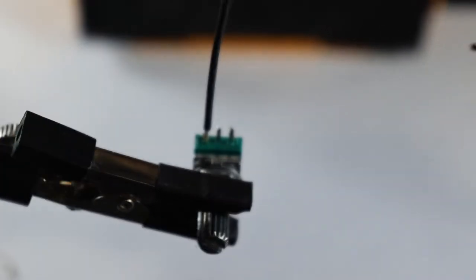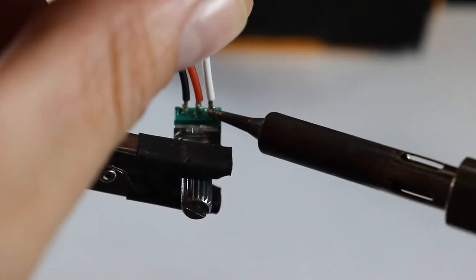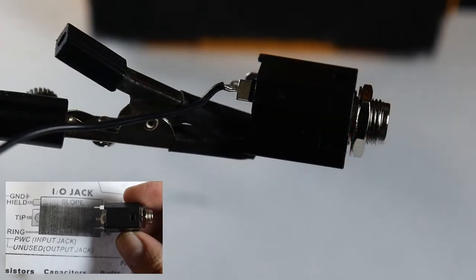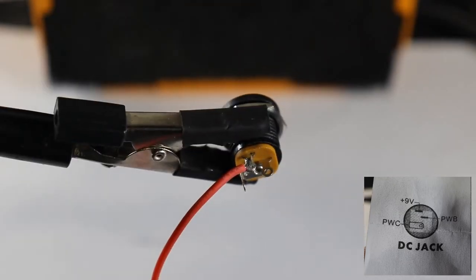Make note that a certain pot, out of our three, only needs two wires. All three look similar, but have different values, so make sure you pay attention to which is which. Thankfully, the jacks have a little hole in their contacts, which makes connecting a wire much easier than it was on the pots.